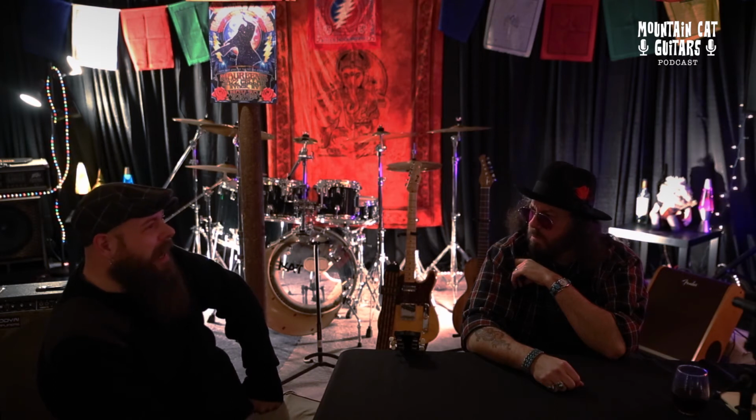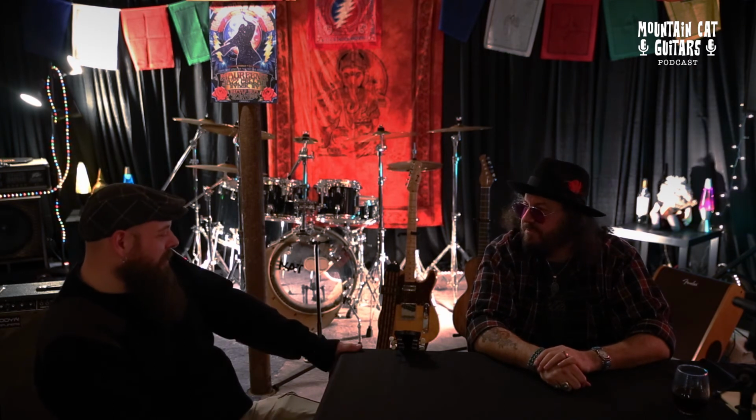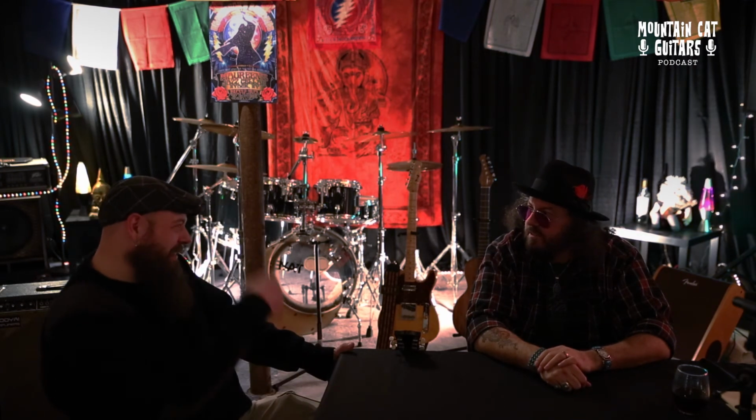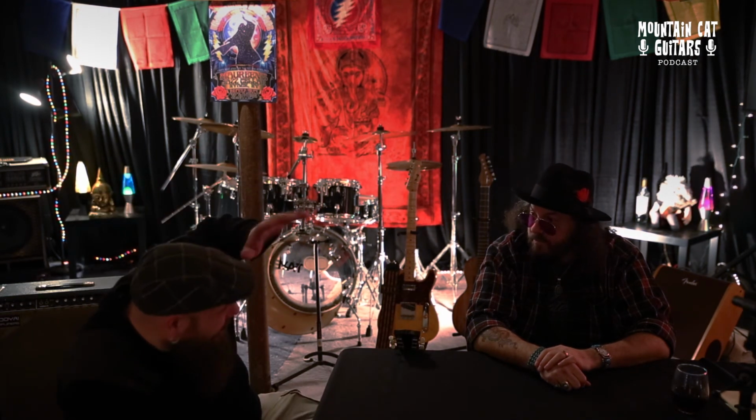I would hope not. Someone told me an SVT is the only amp that has enough current to kill you. Is that not true? No. A Champ will kill you if you hit it right. So that's an old wives' tale? Yeah, you hear in guitar circles that the SVT is the only amp that can actually kill you. No, 6 milliamps across your heart will kill you. So anything can kill you. Yeah, if you're holding the chassis with your left hand and you get 40, 50 milliamps, if you had enough salt that day and your body is just a little bit more solid, then yeah.